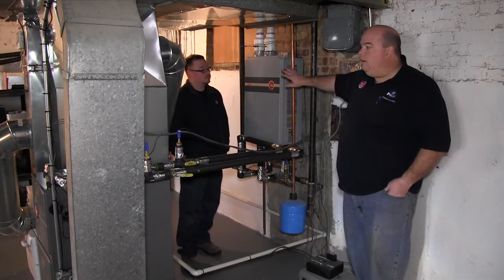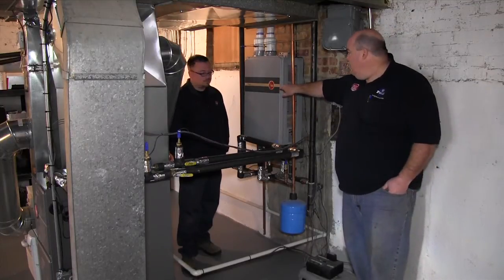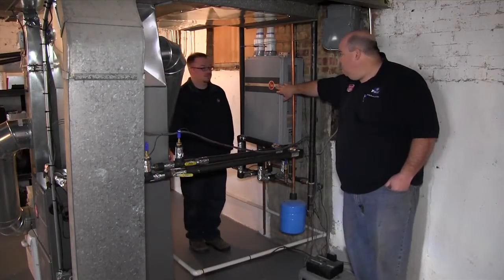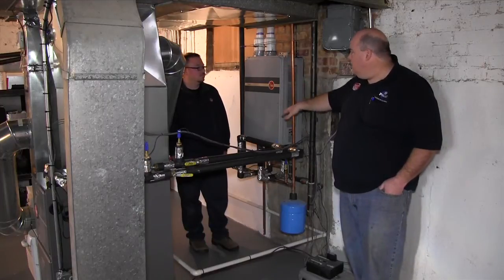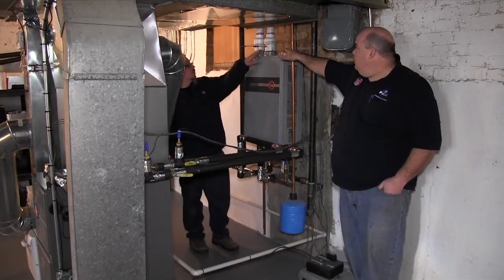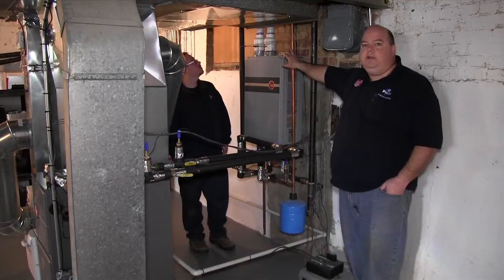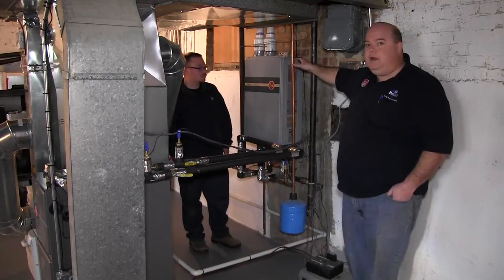There's no combustion chamber in here. This is all done off of hot water that's heated through this system, so all your hot water and all your heating for the house are done off of this little box here. As Billy explained in the prior video going over the maintenance, you have your supply air and your combustion air. This is a completely sealed system — you can literally put it in a closet as long as you can vent it to the outside.